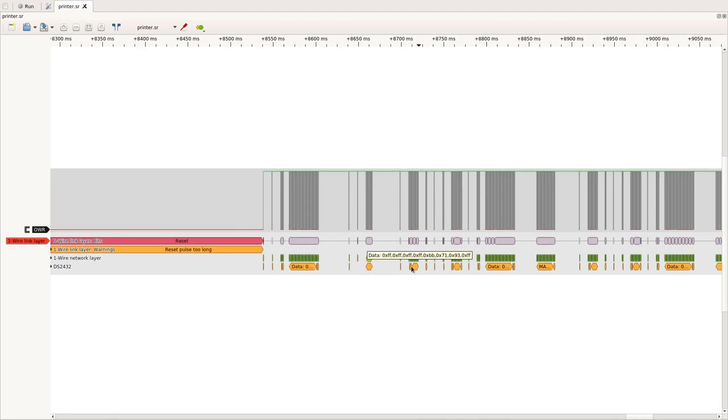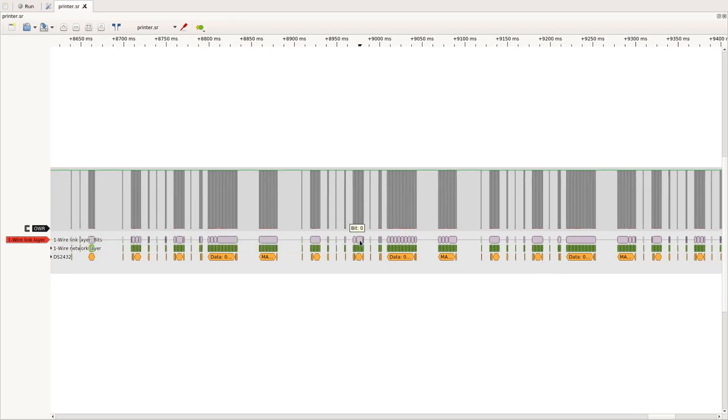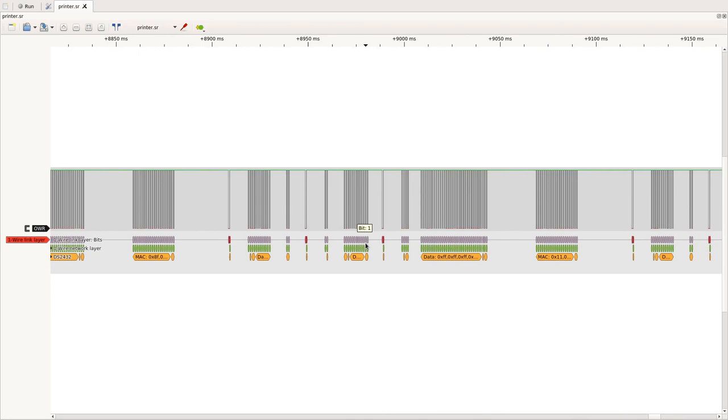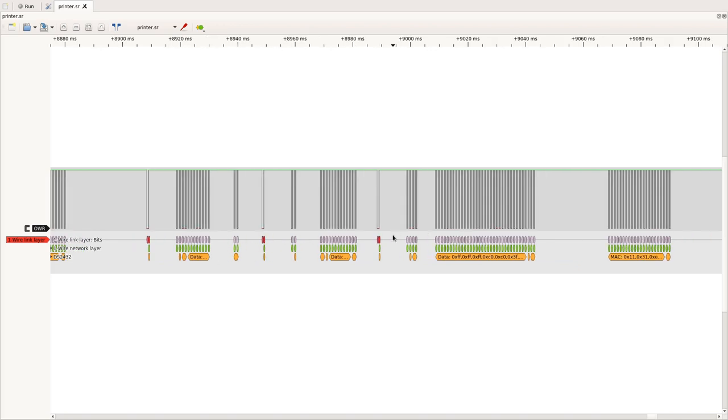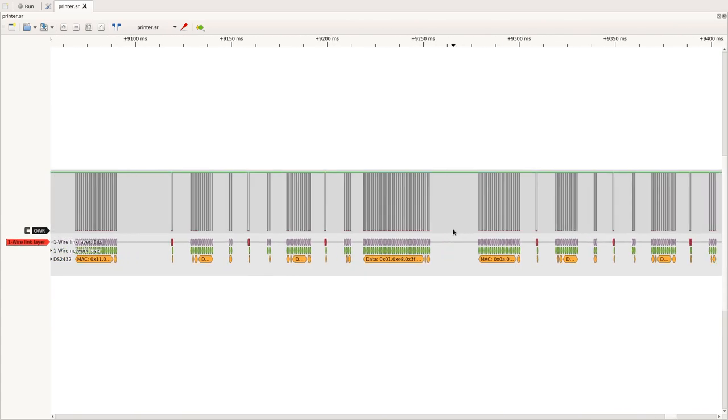And as we can see here, all the trace has been decoded using this protocol decoder I implemented, and it matches pretty well. There is nothing which has an error. There are no fields which are too long. There are no fields which are too short. So based on that, we can pretty much assume that the chip we have is a clone of, or just a rebranding or something else, but it is implementing the DS2432. It has a different family code, but the trace corresponds quite well.